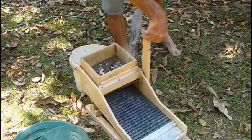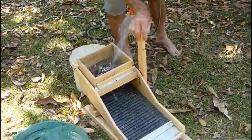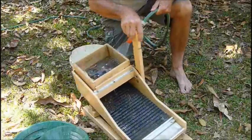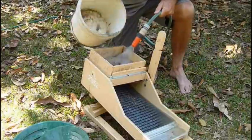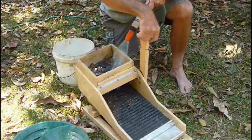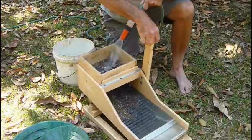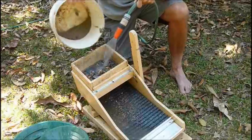Here's the process. I've just got a steady stream of water running through — wash the gravel, get some agitation going so the stuff comes down. The water starts coming down that bottom sluice area and should wash any gold in the gravel through there. The stuff on the top is plus 6mm, so you just check to see if there are any big pieces. If there are any pieces like that, it'll be pretty cool. Then you just dump that to your tailings pile.